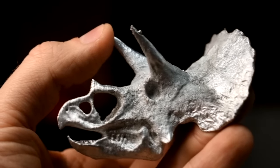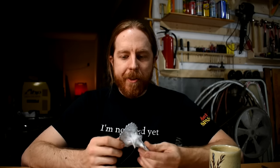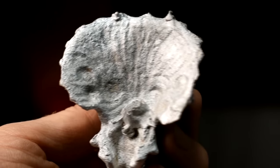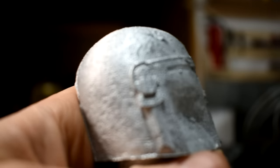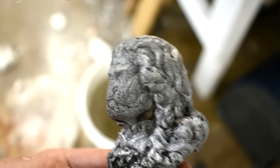I literally used my pocket knife to dig the plaster out poorly, then some pliers to break off some flashing in the vents, and that's it. Take a look. This is the raw casting of the Triceratops skull — the one that did not burn out properly. Look at how shiny it is. Look at the detail. It still looks good. All the really thin spots are filled all the way — thank you, Zamak alloy. We even got print lines showing up. The Mando helmet, aside from some flashing, looks pretty good. It's going back in the melt pile anyway. When I tried to cast a lost PLA Jon Snow and didn't burn it out enough, his face looked like he tried to make out with a wood chipper. I didn't burn this out with this filament and this metal, and it came out fine.